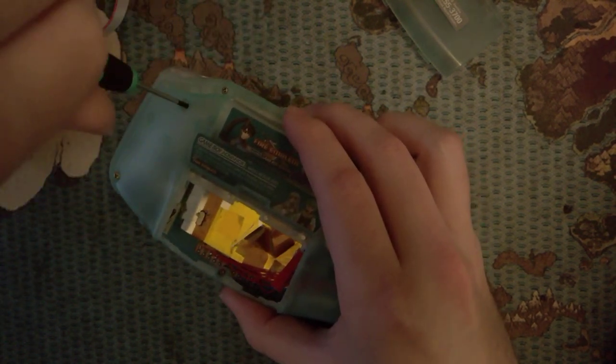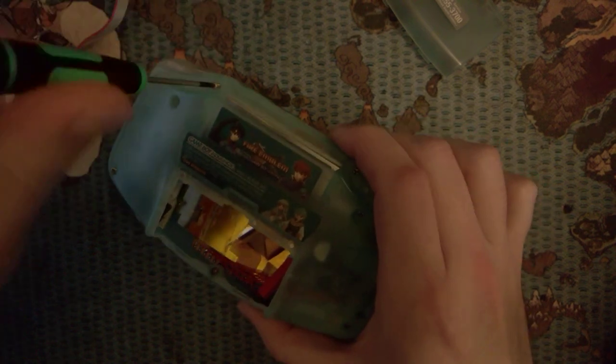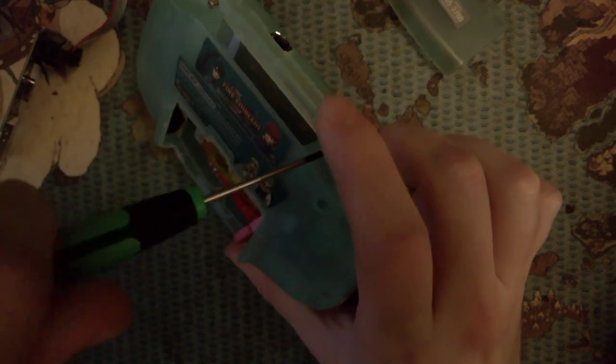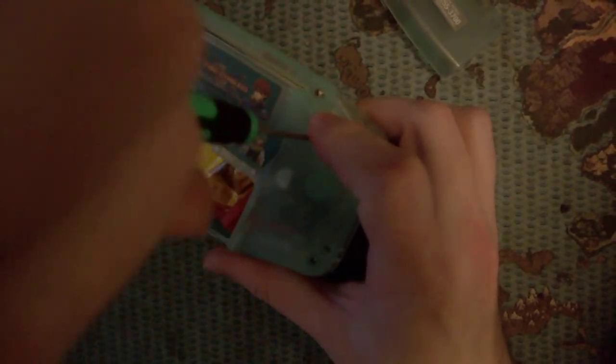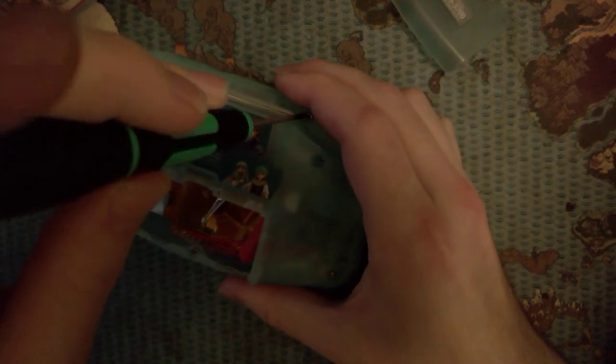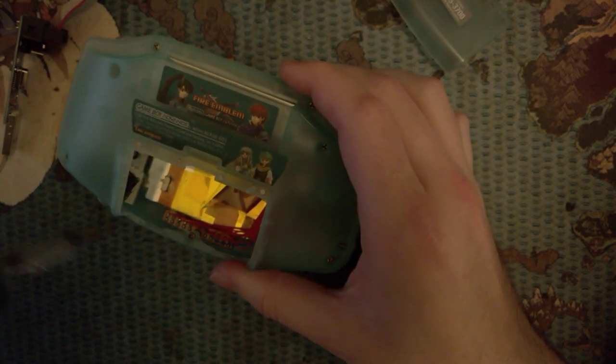So what it sounds like is going on is it's comparing a known value to my actual value as far as the battery level goes, and they're off because it's expecting a different value. So it's reading properly, it's just not handling that data properly because I used the wrong resistor. The workaround is to just use the correct resistor. But the whole reason I used the other resistor in the first place is because I don't have the correct resistor.